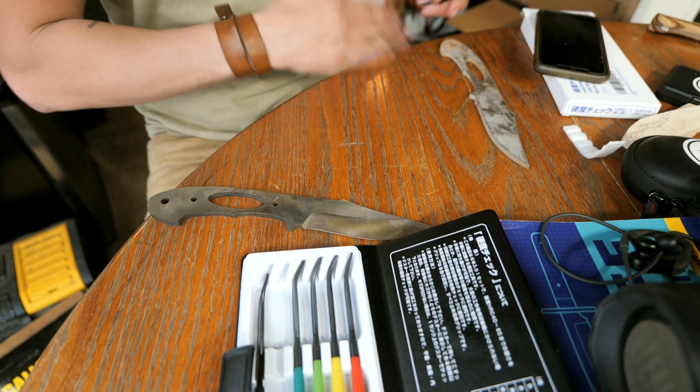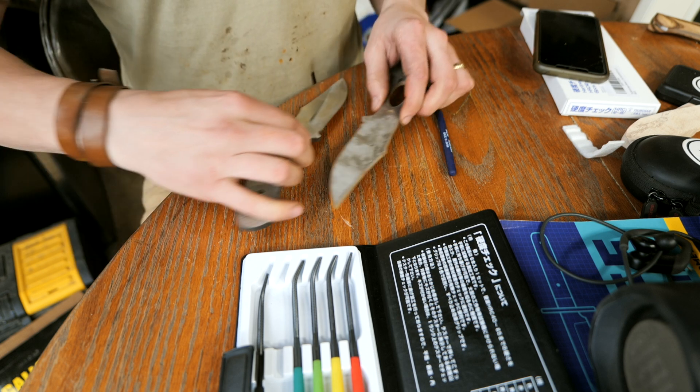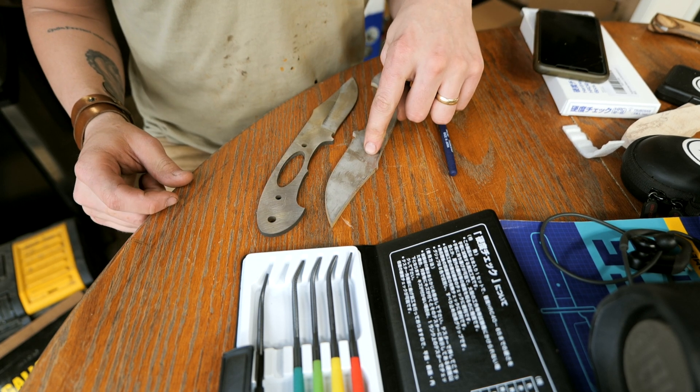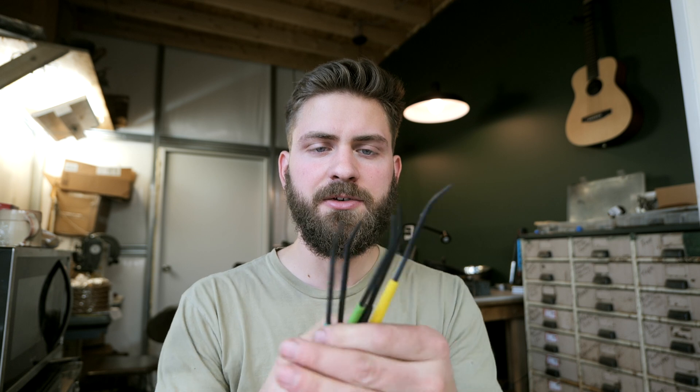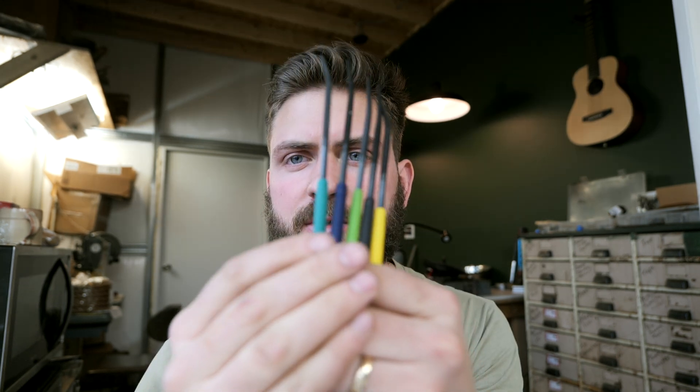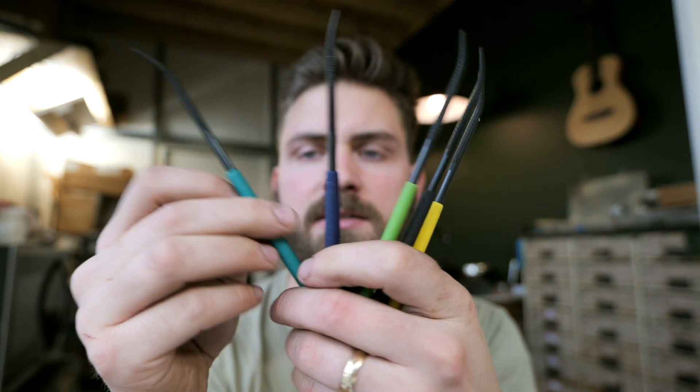So I hope that helps — a good look at how to use these tools. The dead soft blade was less than 40 Rockwell, and the heat-treated Woodsman knife is somewhere between 60 and 65 Rockwell. These are really great little testers for your steel and should provide a good reading on where your hardness is. There's a link in the description for this exact set — it's an affiliate link, so I do get a small financial benefit, but I genuinely like this set.